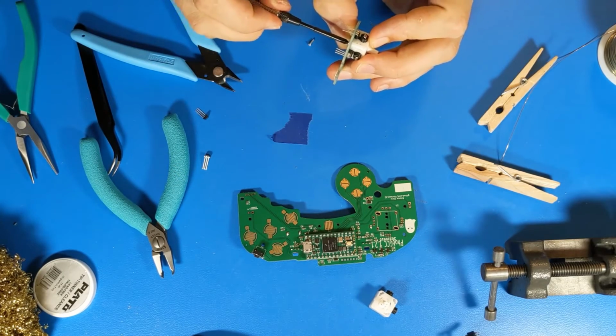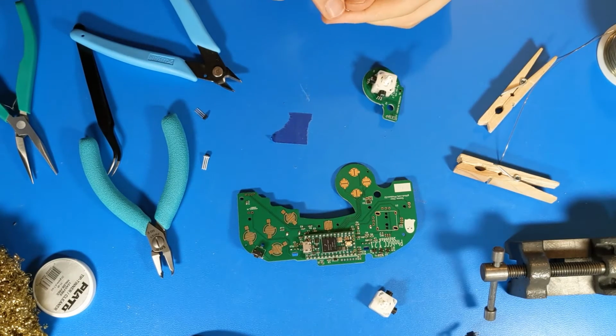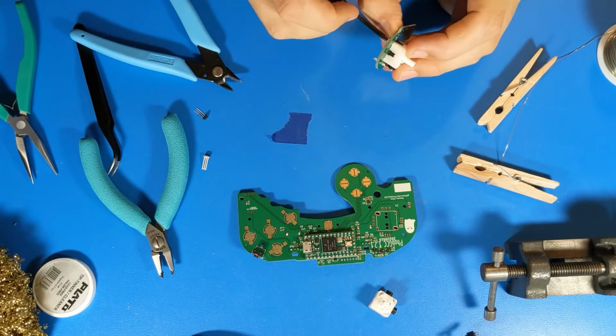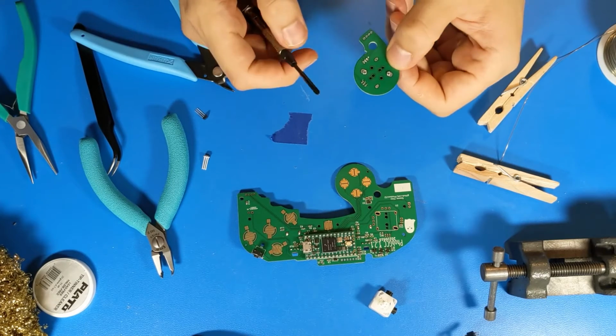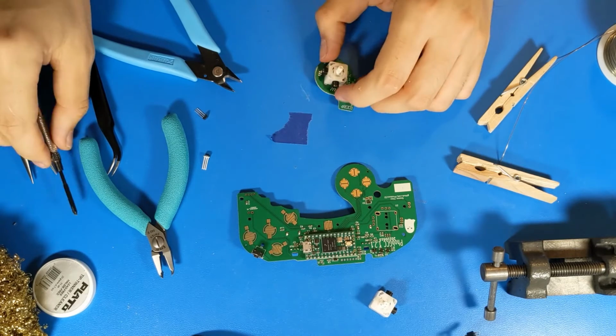If you have a T2 stick box, the metal one, which we don't recommend, although they work, you'll have to solder in all the corners. However, T3 stick boxes are much more long-lasting, less likely to have wobbly sticks, and they're easy to replace because they screw in very easily and unscrew very easily.